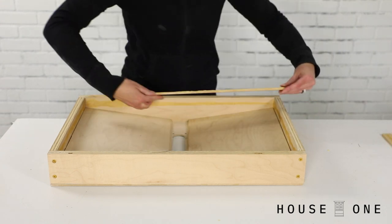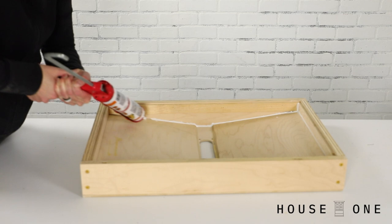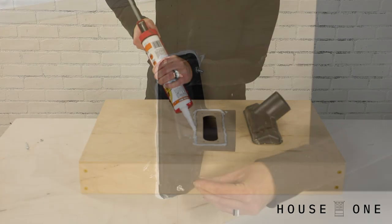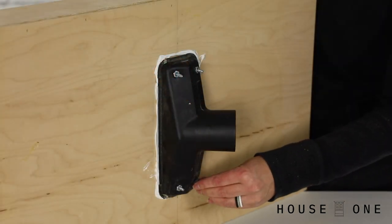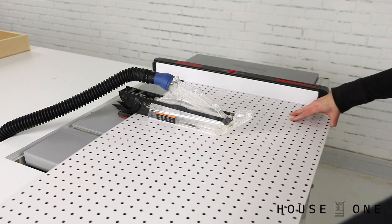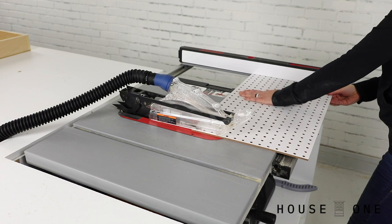I then added the support strips around the top to hold the inset pegboard. I sealed all of my joints with caulk, including the hole around the underside of the box, before permanently securing the back port. When sizing the pegboard, you want a tight fit so that the air doesn't leak out around the edges, but removable in case you lose suction or need to clean out the box.